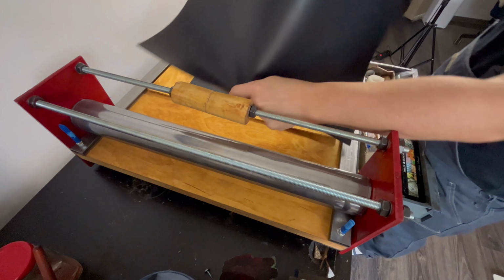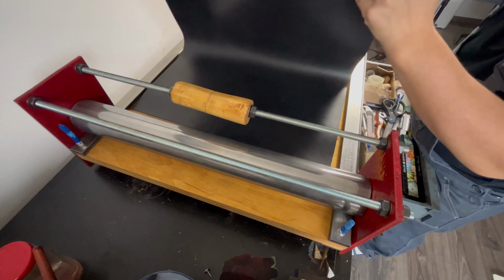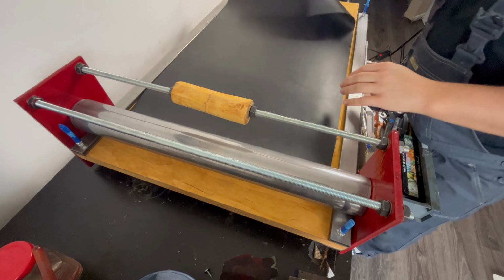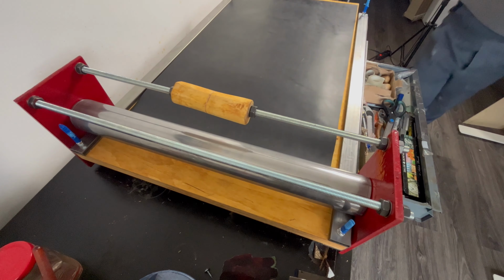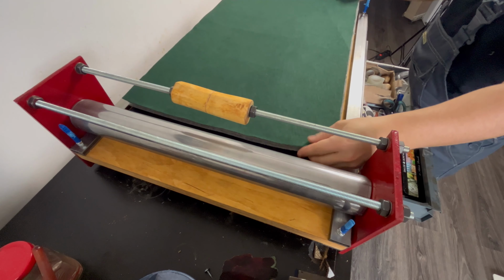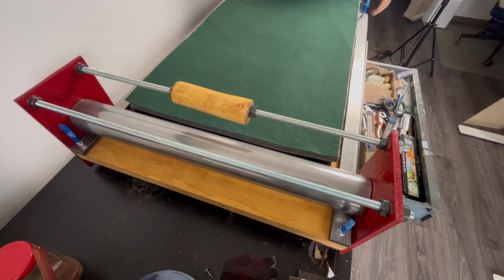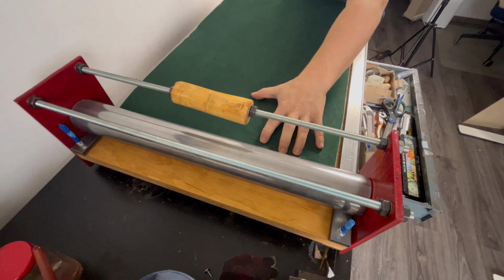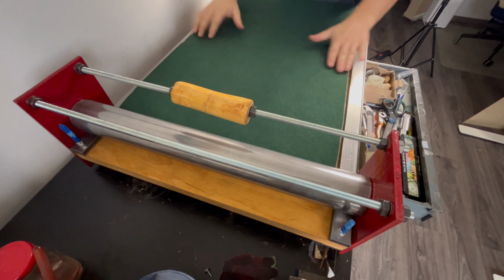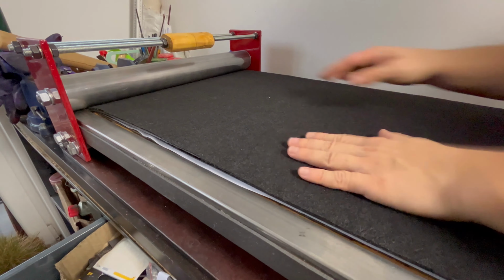The pressure is adjusted by using felts with different thickness and a paper sheet to protect felts from being dirtied by paint. And press.